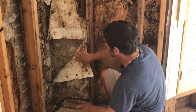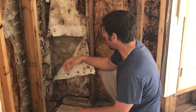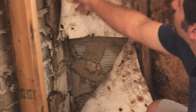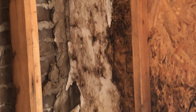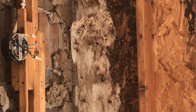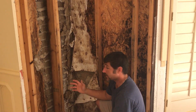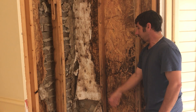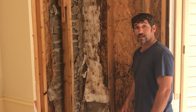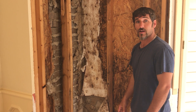It's very important that we use a drainage plane and synthetic lathing so that this does not happen. We can also see a small example here at this corner of mortar damming, where the faux rock meets the brick. The mortar has squeezed through and was touching the house wrap, so we need a drainage plane there as well. We've got another video that covers that topic. For more information, please visit weatherproofingamerica.com.